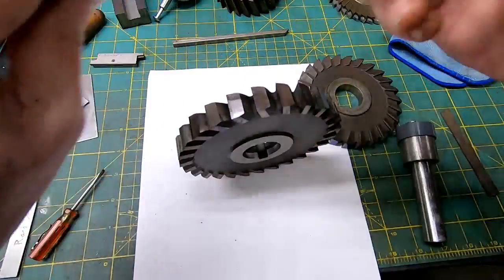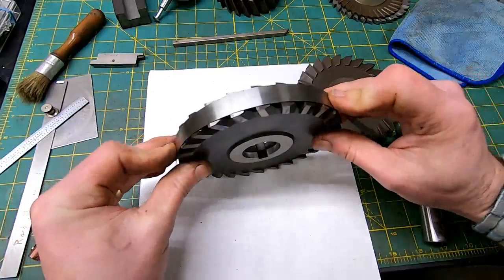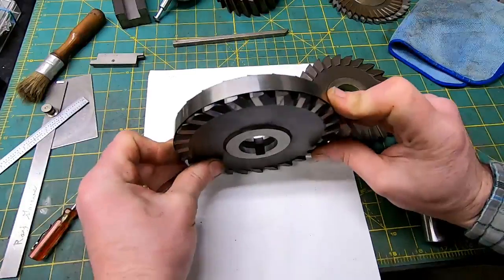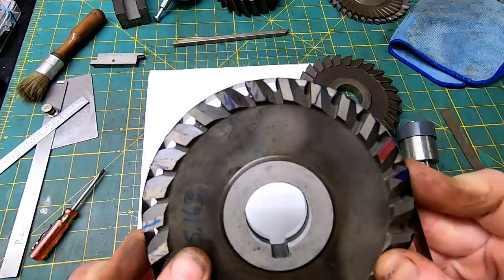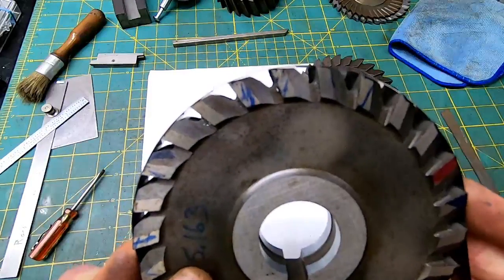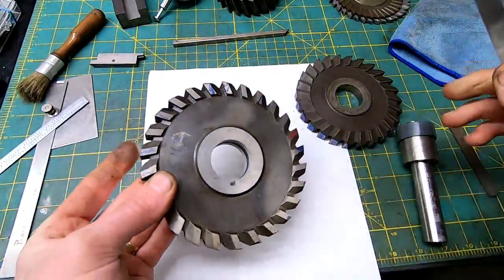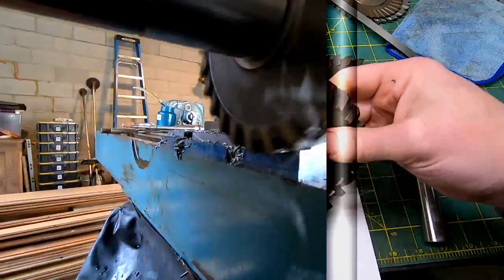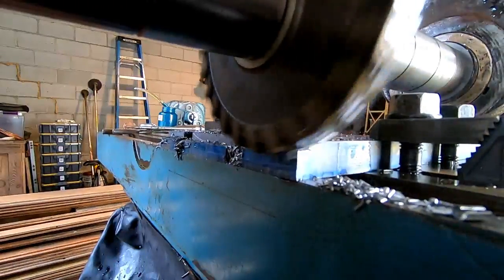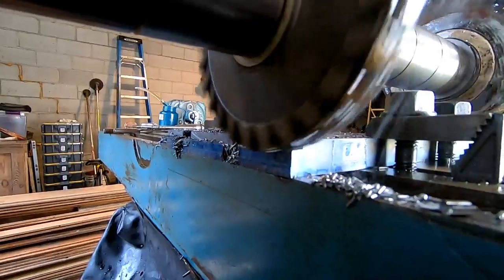Those are just numbers that I picked. I think 3 to 5 degrees for steel on your primaries is fine, and on the secondary, you just need clearance. So, no expert, but I think this will work just fine. And in fact, let's try it. We saw what it did last week. It's got one cutter doing a lot of work there.